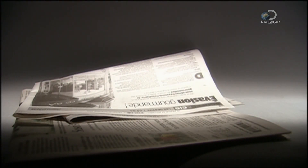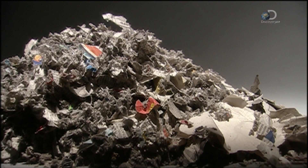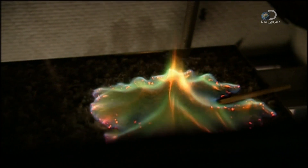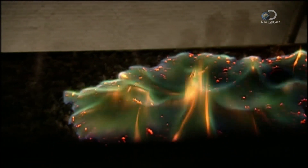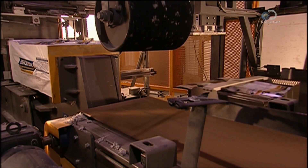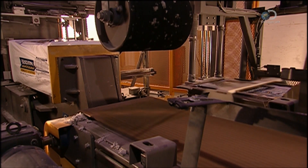From the time the recycled paper arrives by truck to the time it comes off the line as cellulose fibre insulation, only about 5 minutes have passed. The insulation doesn't leave the factory before undergoing thorough safety testing. This test assesses what's called open flammability. The insulation is heated to 50 degrees Celsius to simulate the temperature of a roof in the hot sun. Then it's ignited. The flame travels, but then dies out, thanks to the boric acid. If that happens within a certain distance, the insulation is safe. Outside research firms also test the product for safety, to verify the results of the company's tests.